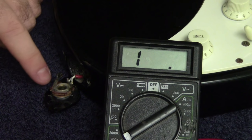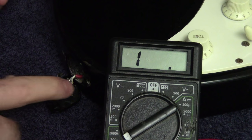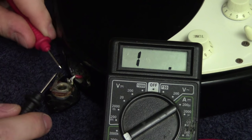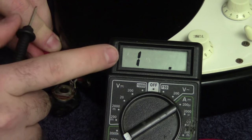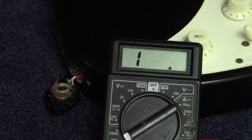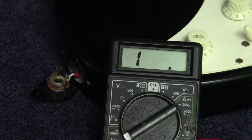In addition to the visual test, I want to verify the jack itself isn't causing the problem, so I'll do the same multimeter test on the two wires leading to the jack. Putting both ends of the multimeter on there, we're still seeing infinite resistance, which confirms that the problem exists somewhere on the other end of this wire, inside the body of the guitar.